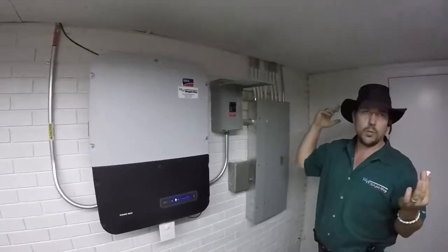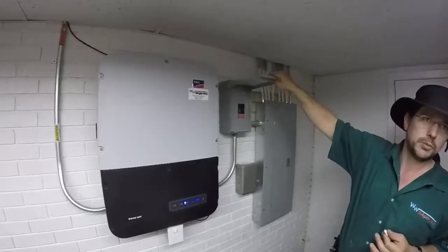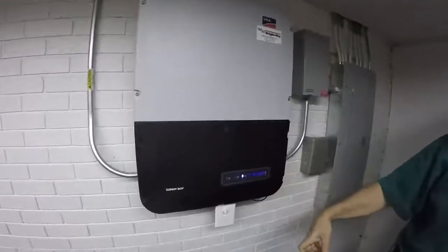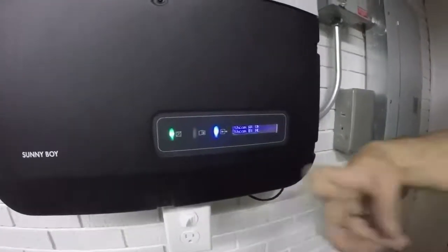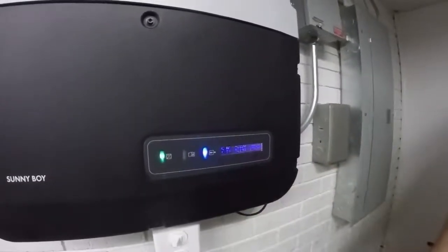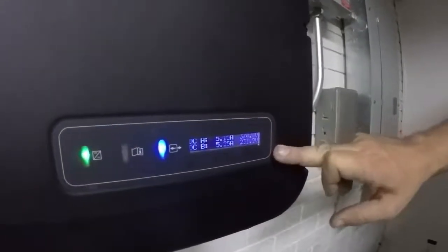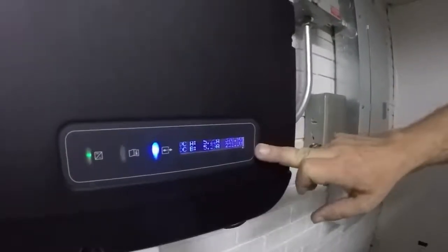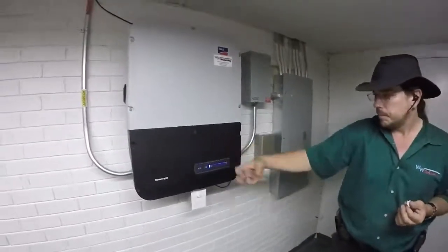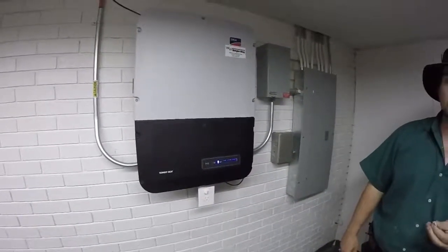That's one of the code-required stickers. It doesn't make much sense in this application, but we just went ahead and put it on. So if you want to read your meter on your inverter, just give it a good knock — don't be bashful, you've got to knock like it owes you money. When you're knocking through, you're looking for the one that's talking about DC, A and B. Those are your strings, A and B. You have a big string and a little string, so they will have different voltages. The amps should be fairly close. And then you have your AC output — pretty late in the day here, we're still cranking 13 amps.